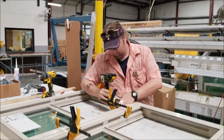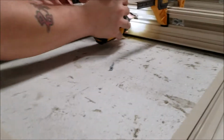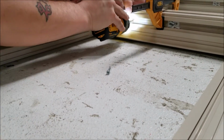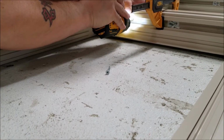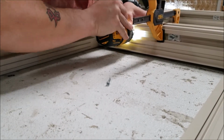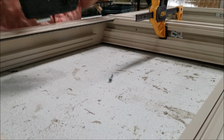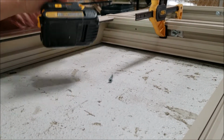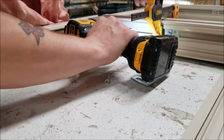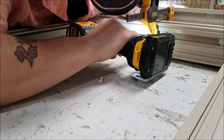In this case, we have an impact drill. I'm going to use my finger and go about half a hand's width, and we're going to shoot for the center. You want to stop slightly before you go all the way in. And this is the tricky part. This is a pretty powerful drill, but you want to slightly dimple the screw. This is that 1.5 screw.